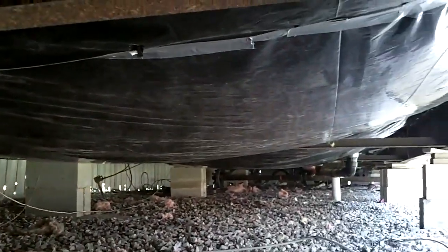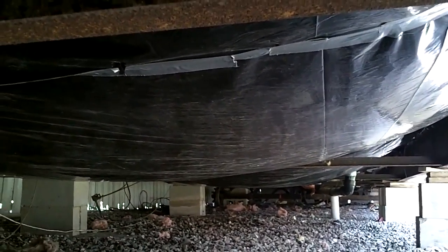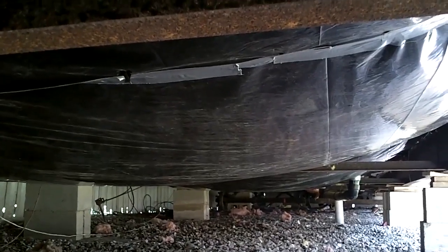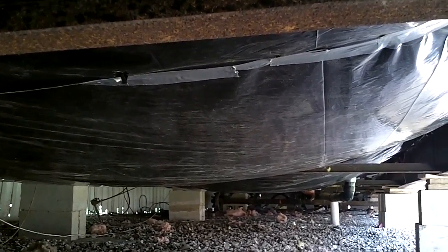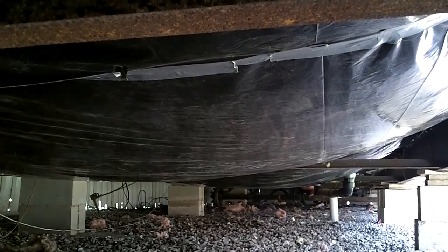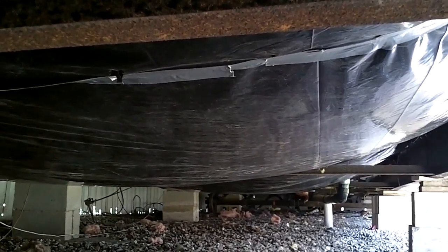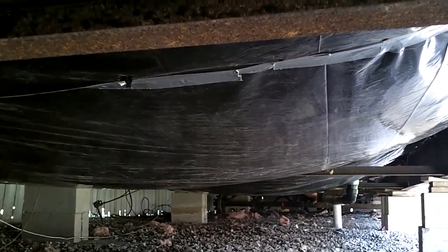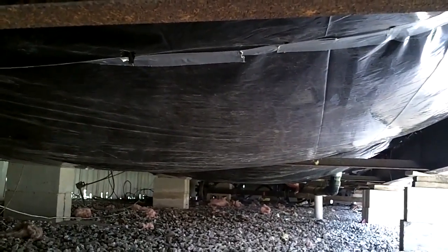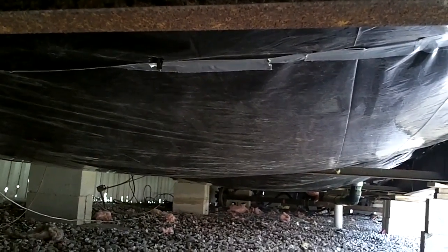All in all, the materials I've got invested is, see, I've got about 7 rolls of R13 fiberglass. And I'm going to have 7 rolls total of 10 by 25 heavy gauge plastic. And then of course you're going to want some strips of wood. They have to be able to bow. Let's see, I've got a heat tape in there. I would say about $150 worth of material, and then my own labor.